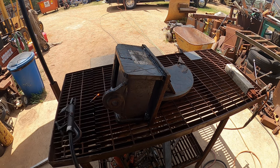Now sometimes, just like the Lincoln machines where they say the arc is very buttery, you can get the same effect depending on how long you let this rod stick out. Naturally, the further you are away, the less the direct air is able to push the molten puddle away, right? But sometimes the further away gives you a softer kind of arc as well. Kind of weird. You have to experience it to understand. Air real close like that blows it away real hard, real sharp. A little bit further away, it does it more soft, buttery, as they say.